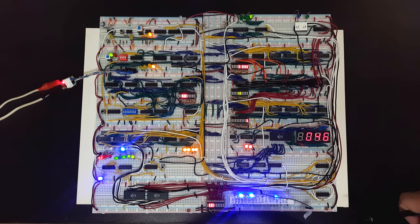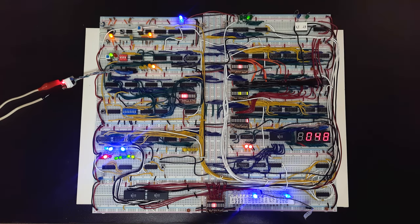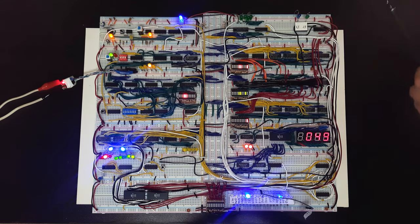So the first module — I'm just going to give a refresher on the modules and what they are. First we have the clock module, which generates a signal that syncs everything together. We also have the A register and the B register, which are used to store data, which is then used with the ALU to add and subtract. It only adds and subtracts, but you could make it do more — I've seen people make the ALU shift values, which makes multiplication easier, and add XOR, AND, and other logic instructions. But we were only sticking with adding and subtracting for now.